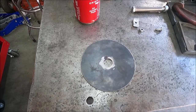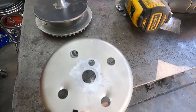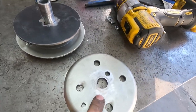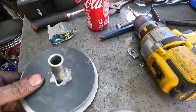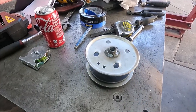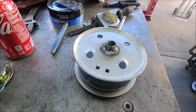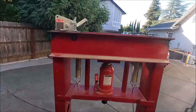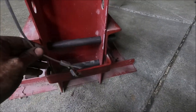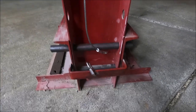I put this piece in an expanding mandrel and put it in the lathe, turned the outside, and made the inside diameter the right size too. All I need to do now is drill a hole right where that black dot is, about a quarter inch — the cable is 3/16ths because it clamps down on the other side, so it has to be able to run through this to the other side also. I got that little hole drilled. I was able to get this piece off — I stuck it in the lathe and machined that weld off and got it apart. This was originally welded on the inside, but there's like a half inch sticking out so it can be welded on the outside, which makes it much easier. Here's what it looks like with that piece on that's going to separate the two cables. I got it welded back together. Now I'm going to fish this cable through here — I'm going to make it so it's just one cable, clamped right about in the center, and it's going to be 28 inches longer on one side because the cable runs across the top. So this side I'm attaching the cable with one of these fittings, and the other side I'm going to make adjustable.